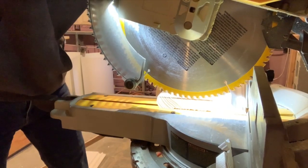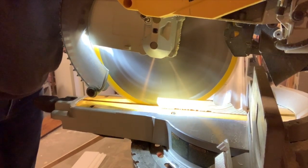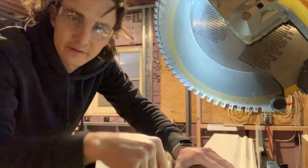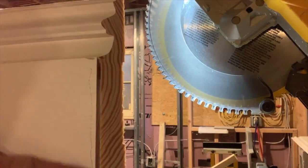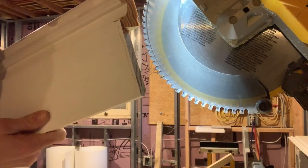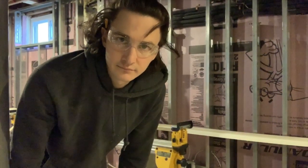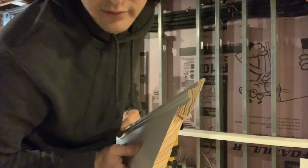It's super important how you power down the saw when you're in the middle of the wood. If I were to have powered down the saw in the middle of that wood, the saw would have kicked and then dug back into the wood. I've taken just a straight cut on that board and kept our profile line there. Now I can go ahead and break this off — now we're going to be onto our cope cut. But before our cope cut, we're taking our third cut with this chop saw and cutting our distance on this other side. The last cut I'm going to make is our length cut on this board. This is ready for cope — I'm going to cut my other ones and then we're going to do all our copes at one time.